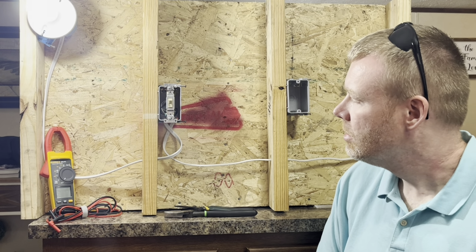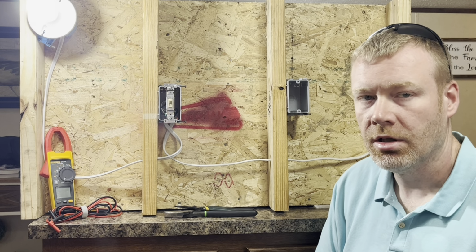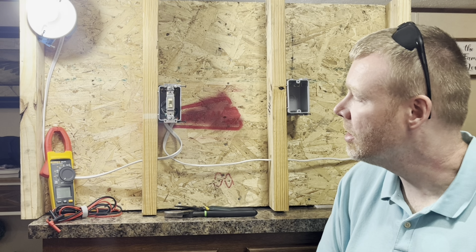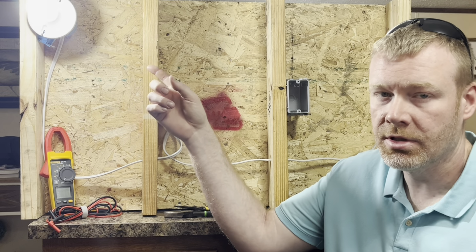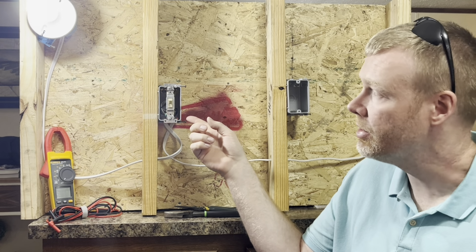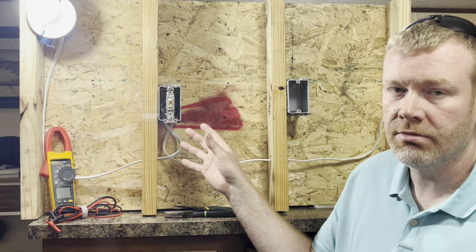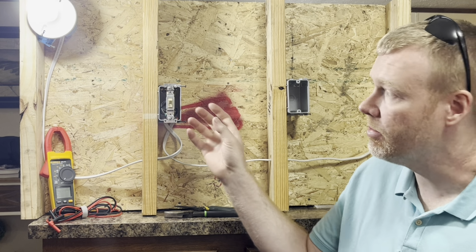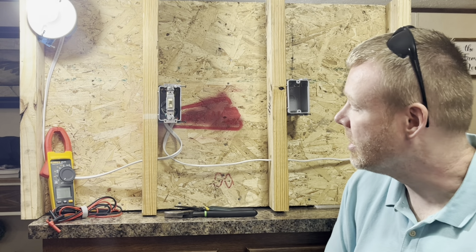Awesome. So this is the basic single pole, single light fixture on how to wire it up. In the next video, I think we're going to call this video done. In the next video, we're going to be coming in from the light fixture with the 14-2 coming from the breaker panel, coming down to the switch box, and then coming back. That way it gives you another scenario, because not all the time you're going to be coming in with a switch box with the power. So sometimes you'll have the power coming in at the light box and then coming down to the switch box and then back. Switch lead, that is.